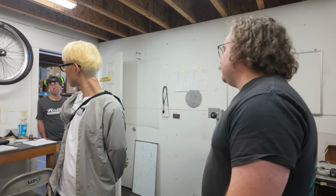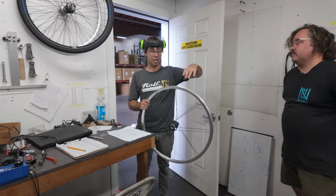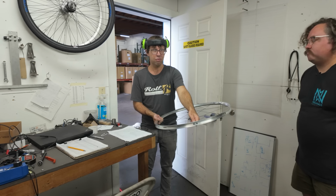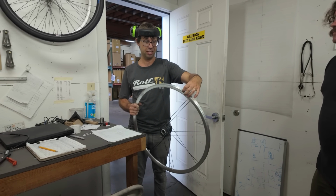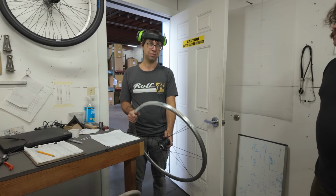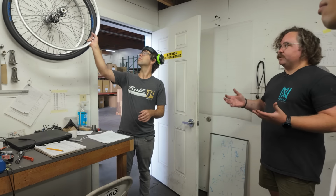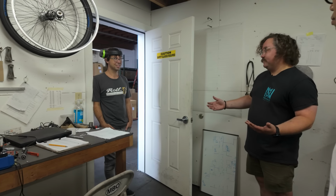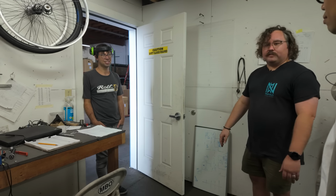So at the end, some wheels will go up to 8,000 minutes. Yeah, especially with the all-road, which are supposed to go all the way down to 28 millimeters up to the big ones. The small, hard tires of 28 millimeters at like 120 PSI, you'll get spoke hole cracks. But when you use a big fat tire on them, you'll get nipple access hole cracks and a variation of stuff in between. So the different tires stress different parts of the rims, and we have to check them all. And obviously a lot of the tests are done at different pressures than you might do in the real world, but they're tested at extremes, basically, to make sure that if somebody ends up doing 120 PSI on a 28 mil tire, which sounds awful to me, they will be okay.